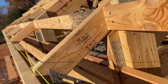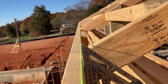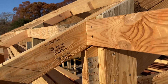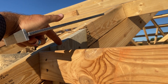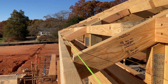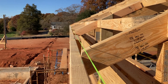If you go down each tail and look down the board, man, it looks straight. What I did is I didn't put my timber lock screws up top yet — I just screwed it to the ears, then loosened all these and adjusted in and out. The wall is really straight on the building and plumb, and I didn't want to screw that up by pushing and pulling things, so I just moved my tails first.